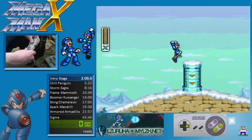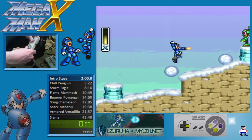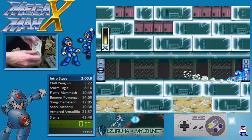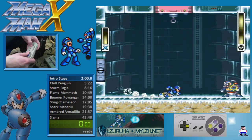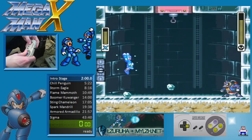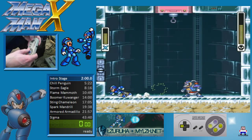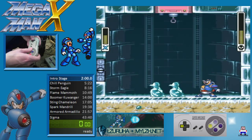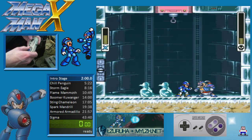I'm going to play through the end of this level to show you the controller display on screen, which is the program I wrote to take the information from the Arduino code and pass it to the computer. It's a really fun learning experience — I didn't know anything about Arduino before this and don't know a whole lot about hardware. But now I'm intimately familiar with the protocol a Super Nintendo controller uses to communicate, which is pretty basic: serial information on the data line based on the latch and the clock. It demonstrates how important timing is, because even though I was writing a program to read the data, the timing was off, so the data wasn't getting pulled at the right times.